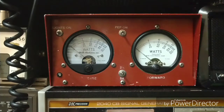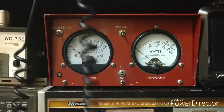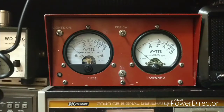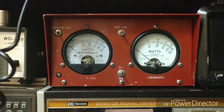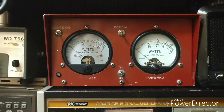I put it on the air every once in a while. But power-wise I left it really tame, because it is just the Bench Radio for testing purposes. It does about 30 peak and 8 watts average. That's low for a MOSFET, as many of you know, but we left it pretty tame for what we're doing with it, because a lot of what I'm working on is the smaller amps and we don't really need too much hotter of a radio than that.